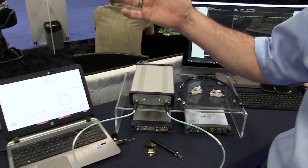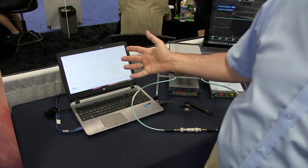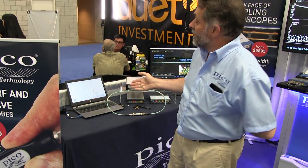This software supports all the usual features that you'd expect on a vector network analyzer. We've got de-embedding and embedding of test fixtures, reference plane shift, and all of the normal expected math functions of a full function vector network analyzer.